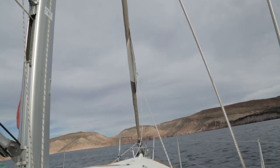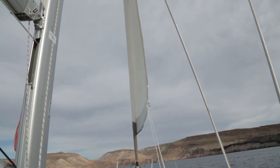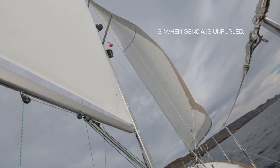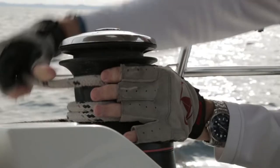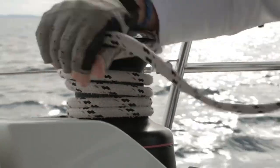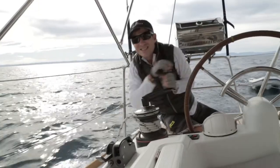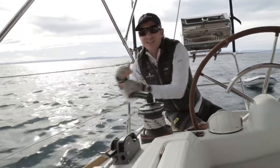It's really important that they keep just a little bit of tension on that line, because if you just let the furling line go, it's going to get overrides and get wound up at the bottom of your furler. Once you've got the full sail out, the person on the furling line can lock off the rope clutch or get it cleated off. The person on the loaded jib sheet can go ahead, fill up the drum, take that line over the feeder, through the jaws, put a winch handle in and start cranking down — looking at the telltales to make sure they get good sail trim on their Genoa.